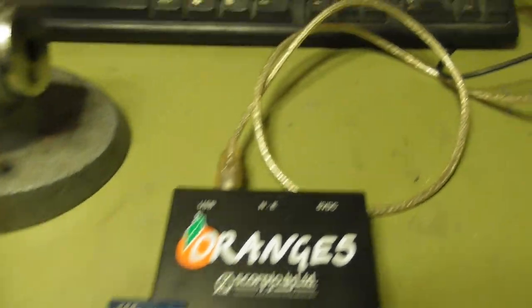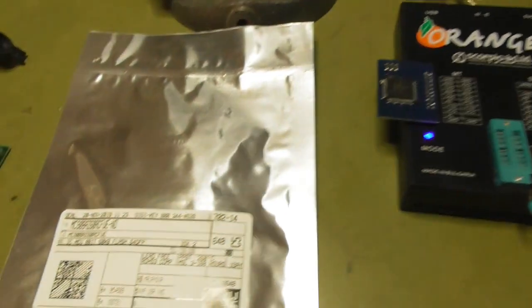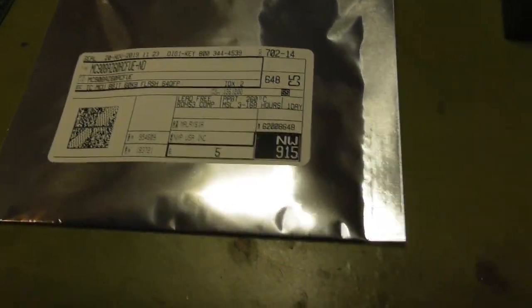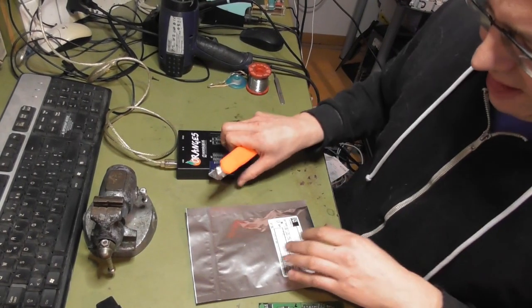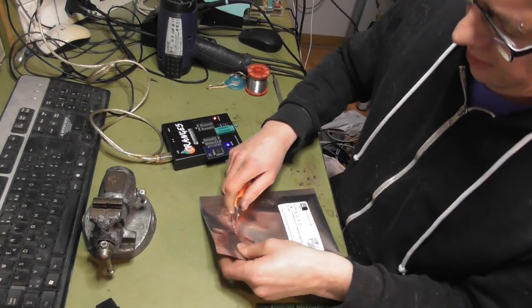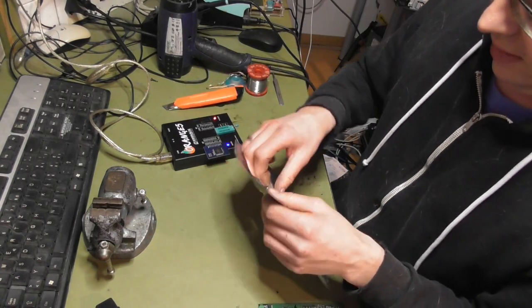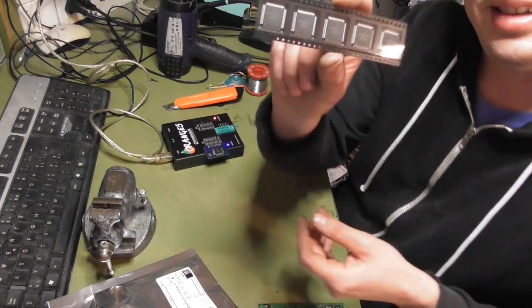That's all. Perfect — that seemed to work. Now here I have new processors, new Motorolas, fresh out of the pack, still sealed. I cracked one open, soldered the new processor to the adapter board, and programmed the read contents. I'm happy these Motorolas are still available because this is real old-school stuff — it's been obsolete for years. Nice and shiny new.